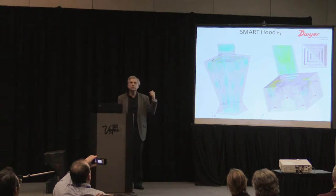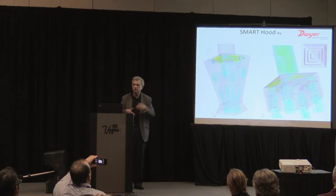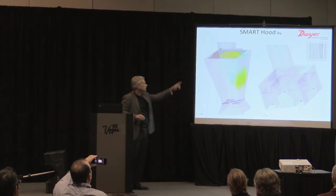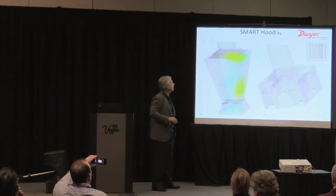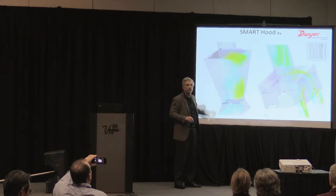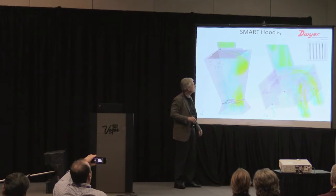We measure the 4 ports, we sum the 4 areas of flow, and we get the total flow in the system. Not too bad on a 3-cone diffuser, like I have up in the corner. I want to show you a single directional diffuser, 2x2 single directional. These are notoriously bad. Lots of balancers know that you have to get a K factor to be able to use these on those types of diffusers.